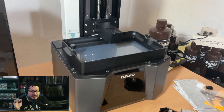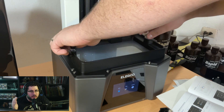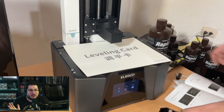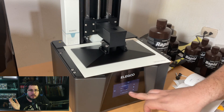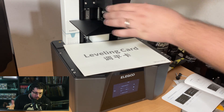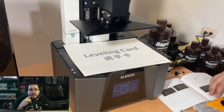Now leveling — some people say it's like a science where you need to really tweak things. To me, these machines are very user-friendly in the fact that if you follow the procedure, nine times out of ten you're not going to have any issues. The instruction is very simple: just go to the tools, zero out the position of the handle while all of the screws are loose. Once you have that, you press with one of your hands — either left or right — and you start tightening the nuts. I like to use a drum technique, doing a cross-section pattern to even out the tightness of the plate.